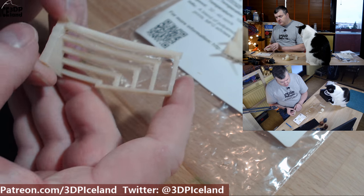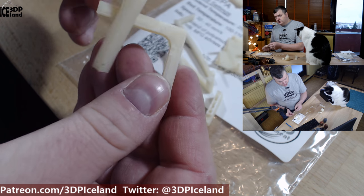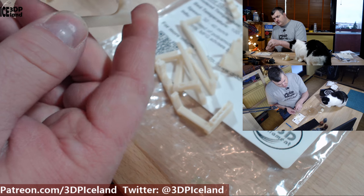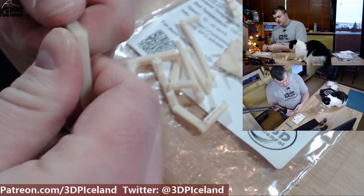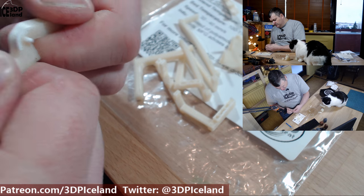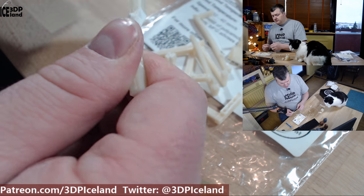Stringing is not a big surprise for a nylon-based filament. The strength of the filament is very good with pretty good layer adhesion — it's quite difficult to break apart. I printed out some samples, one printed flat on the bed and one printed upright. The layer adhesion test was already broken but it had pretty good adhesion overall. The prints tend to bend rather than snap and it's quite difficult to bend, so the nylon is working very well. Strength-wise you get the benefits of both nylon and ABS in this filament.